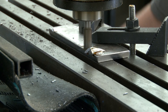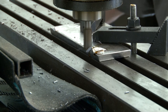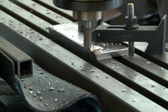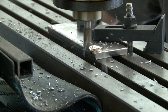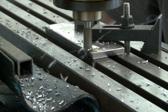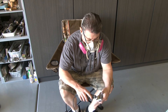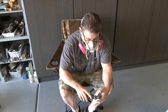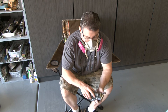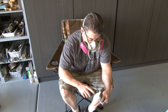I use my mill just to cut the gates off the mold. There are plenty of other ways to get it off but this is easy for me — I clamp it down to the top, offset it by a thickness of a paper, and just go right over it. Then I clean the back up on a belt sander. I have some Scotch-Brite Dremel attachments, and I'm using a mask because whenever you use abrasives or you're grinding on metal you don't want that stuff in your lungs. You'll probably live a little longer if you take care of yourself.